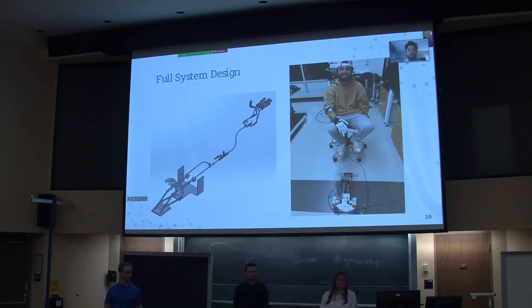One of those valves connects to two different types of tubing. One runs into a three-way valve. As you can see on the right-hand picture, the three-way valves are connected to the pedal assembly. As one pedal is pressed, air travels through the inlet tube into the system, and the other pedal will fully depressurize the system.